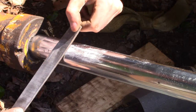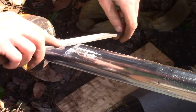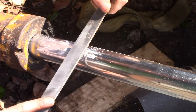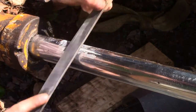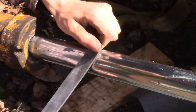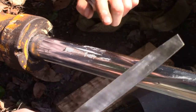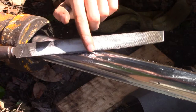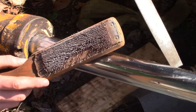One more trick: instead of filing across, once you get close to being done, file one stroke this way and rotate it over so you don't end up with a flat spot. You can kind of feel when you're almost done because you'll feel the file skating over the metal rather than digging into the epoxy. After a while your file is going to get loaded up with epoxy dust — that's where a file card comes in.